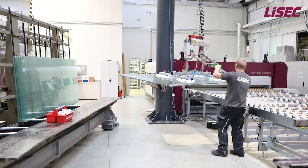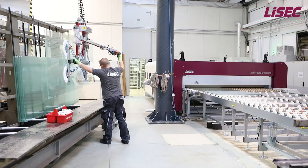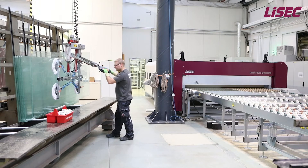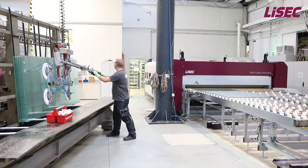If customers want to increase their existing lamination quality and output, LISEC offers a pre-nip exchange. LISEC delivers a new pre-nip machine and connects it to the existing assembling machine, including from third parties. The full structure is very uniform, demonstrating the accurate and gentle pressing of the servospindle press technology and the homogeneous heating with infrared and convection.